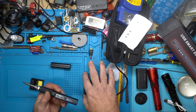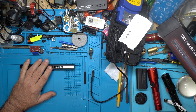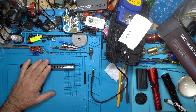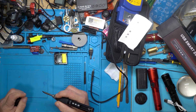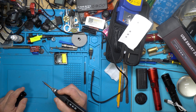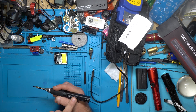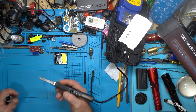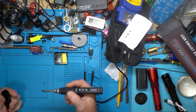There she is. There's not a whole lot to talk about. The menu system on this iron is very minimal. I don't fault it for having to do the calibration offset of 30 degrees Celsius, because the HS02A, I had to do a 70-degree offset on it — that's how far it was off. My thoughts about this iron: functionally it is a short tip, it's about the size of the HS02, so it's a very close comparison to the same iron. But with an even more minimalist interface. You turn the iron on and it's just up or down, turning the heat up or down. You set it there for five minutes, it kicks into sleep mode and cools down. You pick it up and it fires right back up again. Gets up to temperature quick.